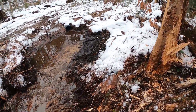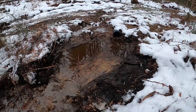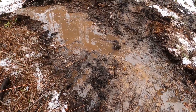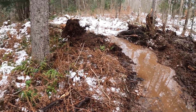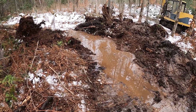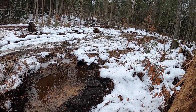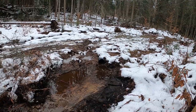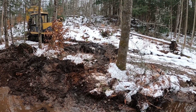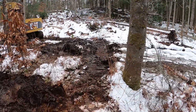I had a chance to clear out the discharge. This particular culvert was about half full on the outlet side because of the rock, the ledge, the bedrock there. There's still a lot of bedrock, but I was able to scrape away some of the topsoil, a junk tree, and some stumps and allow it to drain. It'll still settle out and be stagnant there for a bit before it takes off down the hill, but this is a lot better. It should make finishing up this road next summer quite a bit easier with the water level four to six inches lower. Still a bit of a muddy mess, but I'll fix that in the summer with fabric and some fill — either gravel or some clay from elsewhere on the property.